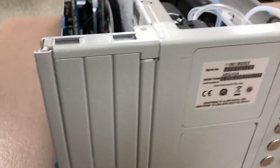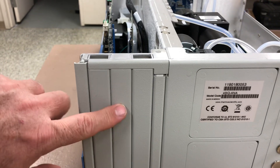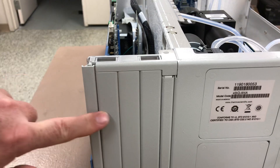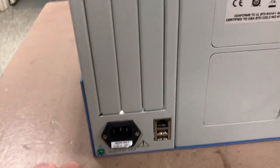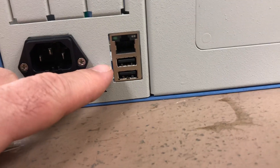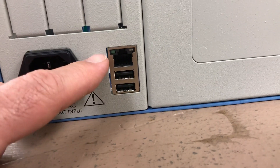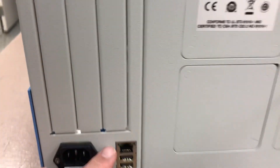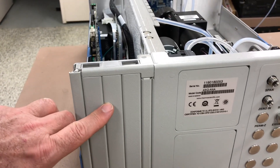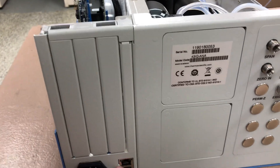Looking at the back electronics, this analyzer was purchased without the RS-232, the analog outputs, and the digital inputs as well. So you now have the option of not buying these, which helps reduce cost. They come standard with Ethernet ports, and there are extra USB ports on the back panel as well — you have two. The Ethernet Modbus is what a lot of people are now choosing to get data off these instruments, instead of going with the conventional analog RS-232. Digital control is all done by Modbus as well.